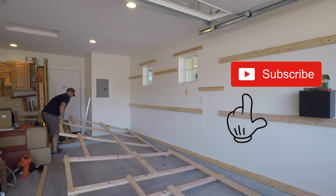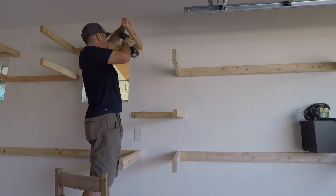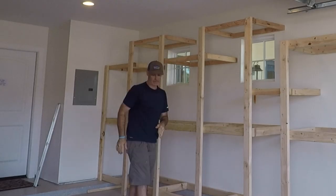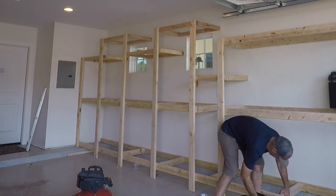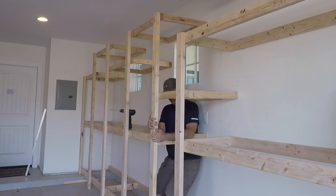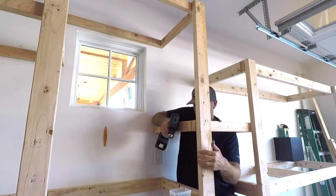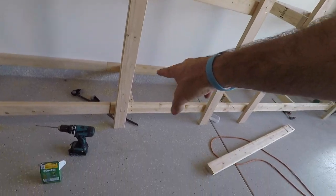Before I attach these supports, I need to pull out the front frame I built. Off-camera, I unscrewed most of the temporary screws, leaving two in just to hold the frame up. I use 16-gauge two-inch nails to temporarily attach the vertical frame to the horizontal pieces, then go back with two-and-a-half-inch screws to finish. One part was a little warped, but since I cut everything quickly it didn't warp much. These shelves are extremely sturdy — I weigh about 193 pounds and they don't move at all.